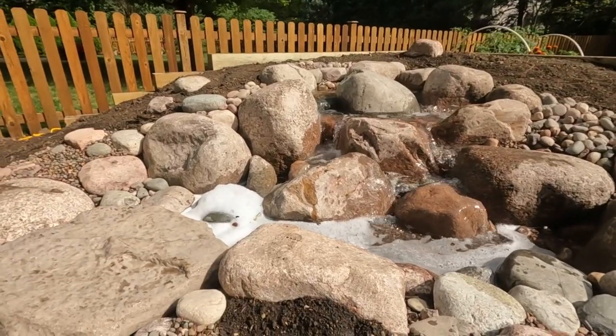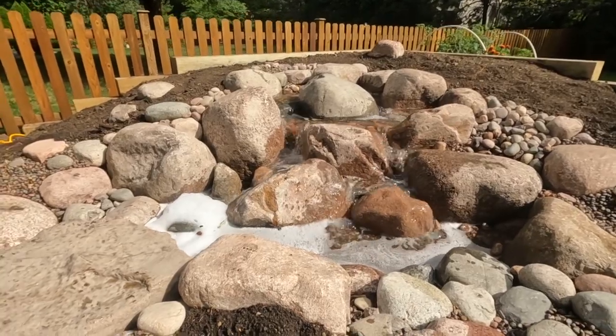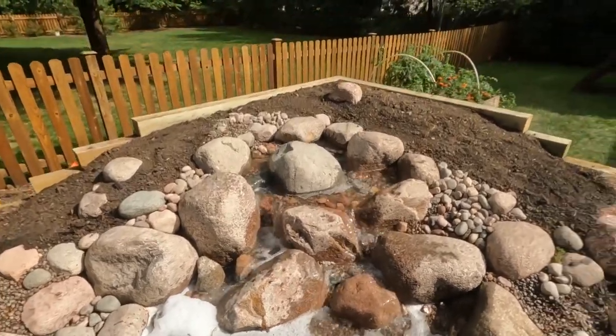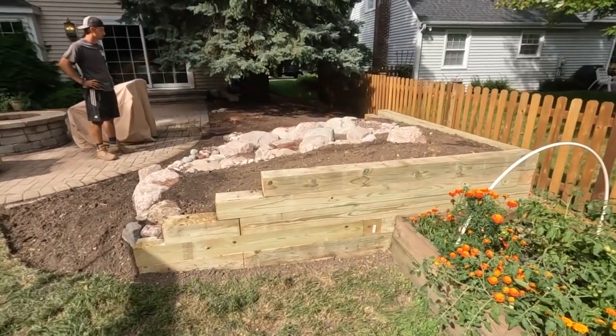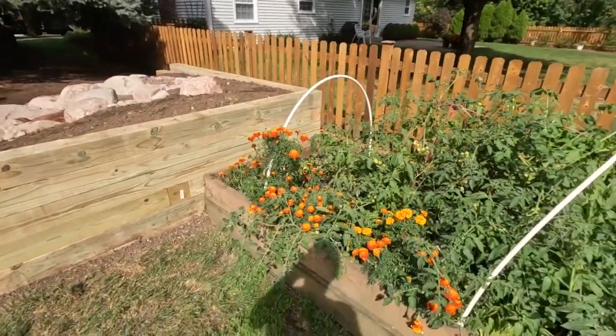All this foam is just from the debris that comes in from the super sacks of gravel — once that all gets washed out and into the basin, it'll clear up nicely. Can't say enough about how much I like this berm as well. We brought in just some six by six timbers and used all the dirt excavated from the basin — threw it right up on top. It tied in nicely to this planter, and I'm looking forward to the next project. See you guys next one.